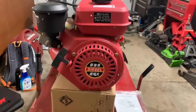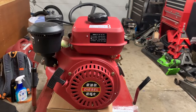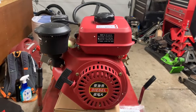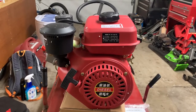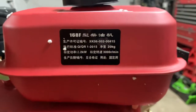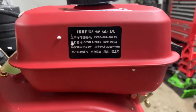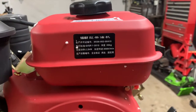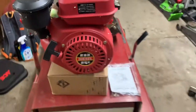It's 2.2 kilowatts, which is about four horsepower at 3600 RPM — they call it six horsepower on eBay, they're bullshitting you. Wait — 2.2 kilowatts at 3000 RPM, so conceivably it might be good for 2.5 to 3 kilowatts, so again four to four-and-a-half horsepower at 3600 RPM. Possibly no more than two kilowatts — I don't know. One way to find out.